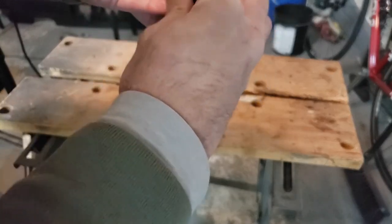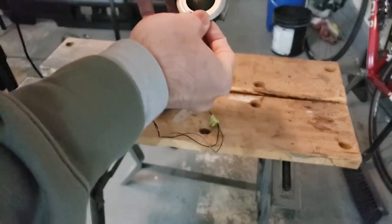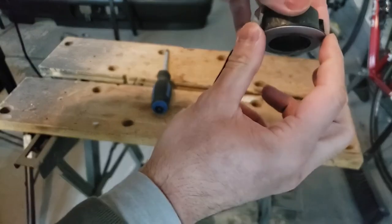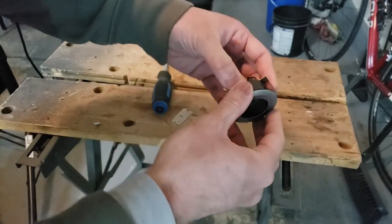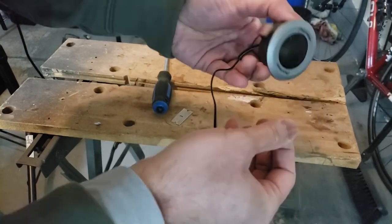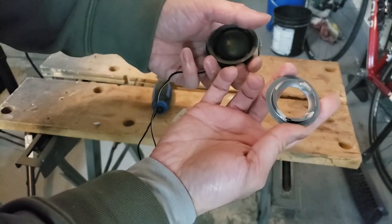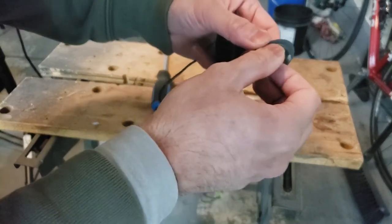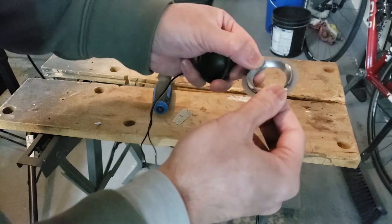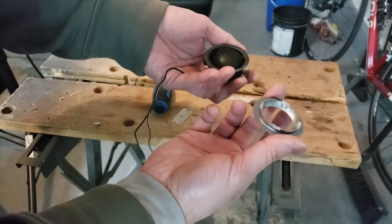So let's just twist this on. Yeah, there you go — twist it on. That's not bad. It's holding. There's no real huge gaps or anything. Only time will tell once this is assembled back onto the door panel, but aside from that, it's holding. It's pretty good. I'm happy with the repair. You could actually use this method to repair these tabs on other plastic parts that you've broken. You basically have to somehow create a mold or shape for it and cut away at the excess material so that you have the shape right. As long as it's hidden and you can't see it, you should be able to use epoxy to fix certain tabs.